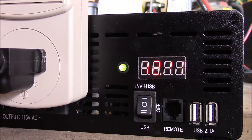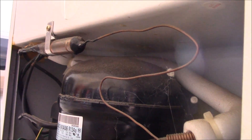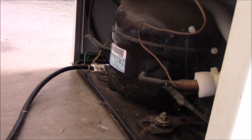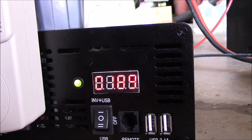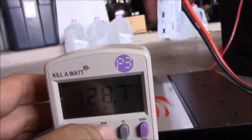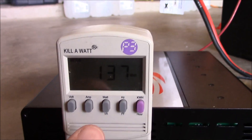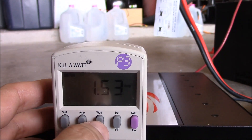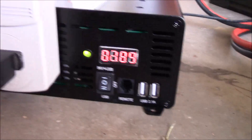It's working! You can't hear it on the video, but the motor kicked on — I heard it running. The refrigerator is on. It's not cold yet obviously, but it is running. We've got just under two amps that this thing is pulling. 137 watts — that's about what it should be pulling when it's running. That's about what it's rated for, around an amp and a half in continuous mode. Finally we got a result!